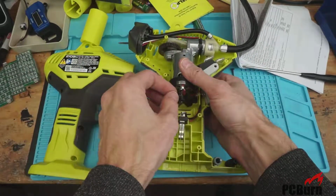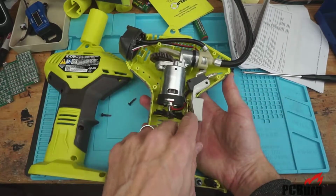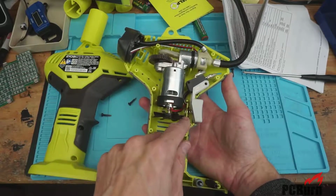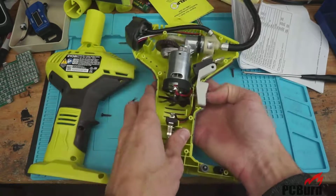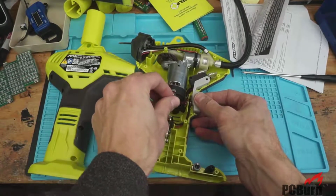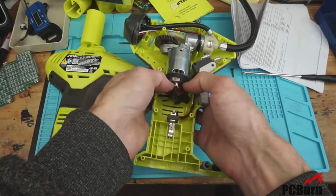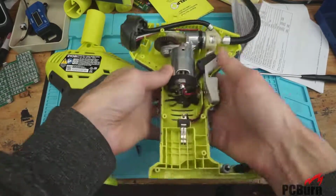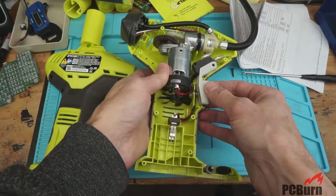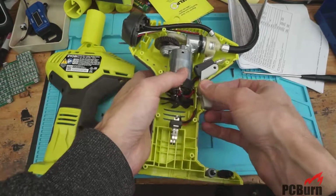It looks like we're still using our same fan design here. So that might be what happened to our original fan. Looks like this spring is just stuck out behind here. That could make contact with the fan pretty easily if it rotates a little bit, gets sprung out, things wobble around in here as they will, because this is all on rubber to try to silence the noise somewhat, so it is pretty mobile. And yeah, you could completely contact that spring with a fan and chew it to crap. So that's probably what happened to our original.